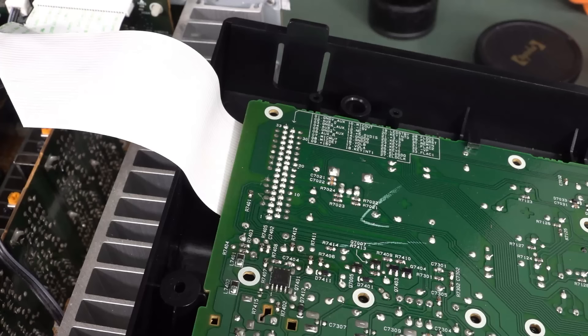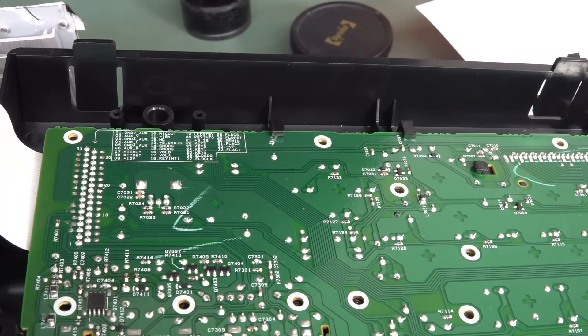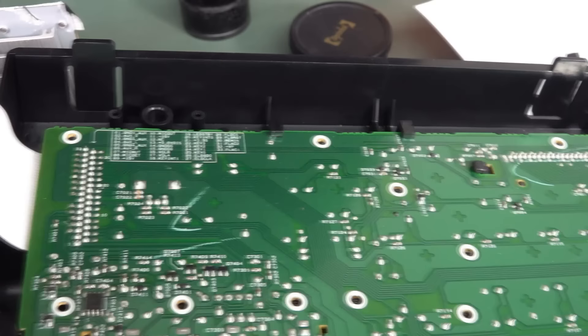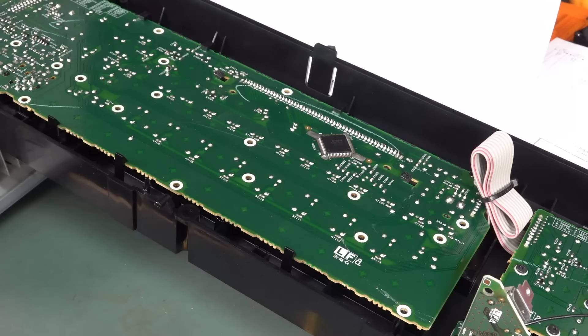Oh, I get it now — look! Pin 1 is pin 33 and vice versa. It's just upside down compared to the PCB. It's obvious — I've got the Australian version of the schematic. D'oh! The moral to that story is: when you notice something weird, follow it. Like, I noticed the voltage wasn't what I wanted. I was measuring the VP pin on the chip and wasn't getting it. I was trying to trace it back — you need a ground reference to measure it — and I was choosing the connector over there, and it wasn't right. And then I thought, is this ground? Have I got a dry joint? Is there a bad link in one of the links, because this is all a single-sided board so there are all these jumper links? Maybe one of those is bad. I could not buzz the ground pin of this. I ultimately went: right, I'm checking that the ground pin goes over to ground here, and it didn't. And then I kept following and I realized — d'oh — the pinout's wrong. So don't ignore that niggling feeling that something's up.